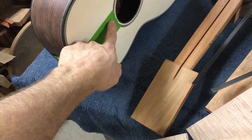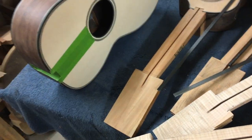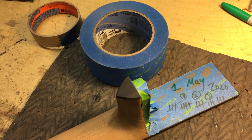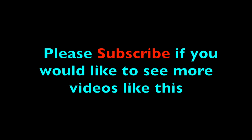If you aim at one thou of thickness for each coat, that's kind of a good thing to go by. You can test that by the fingerboard tongue over the body — after the second day of spraying clear coat you can just peel off a little bit of the finish off that area and see how thick it is. If you want to mask off the bridge area you can do that. I hope that was of help. It's kind of a boring video with just watching me taping, but I hope the end was kind of exciting. May the fourth be with you. Peace out, brothers and sisters.